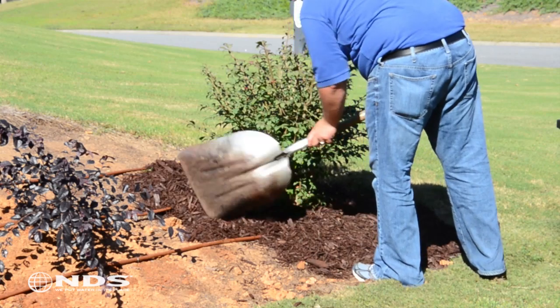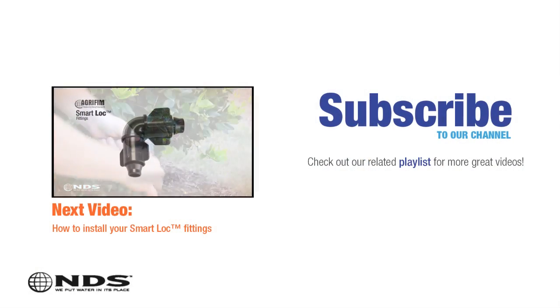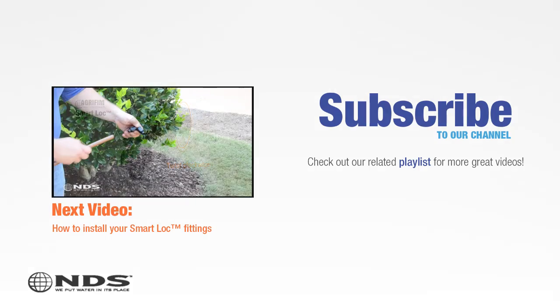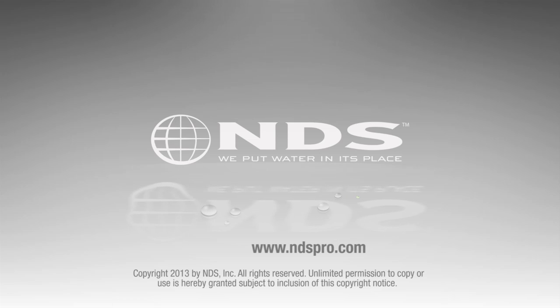Select your desired ground cover mulch and place a 2 to 3-inch layer uniformly over the planting area. That's an easy way to install drip irrigation on a hillside that will save you both time and money and give you the highest efficiency possible for your landscape irrigation. This installation shows how effective drip line can be — its slow, targeted application of water virtually eliminates runoff and can work in all soil types. It applies water directly to the plant's roots, resulting in the healthiest, best-looking plants possible. For more information on NDS drip irrigation products, check out our other videos. For more than 30 years, NDS has been a leader in water management solutions. For more information on drip irrigation solutions and special offers, go to ndspro.com.